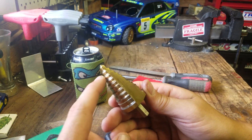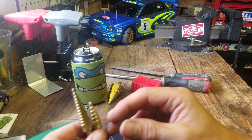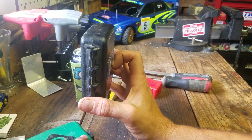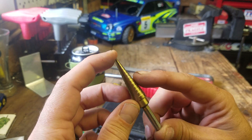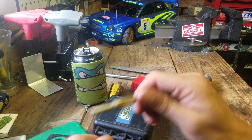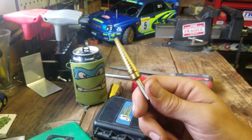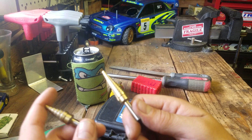This set is a two-pack for $20 that comes with one up to a half inch, and there's also a three-pack set. These have been really handy. For instance, if you have a box you're trying to mount and it comes with three or four mounting holes, and you need to mount it to a block wall — you drill your holes out, go to screw it up, and no matter what you do you can't get the box level. What you can do is take this and knock those quarter inch holes out to 3/8 inch, maybe use some washers, and then you can wiggle it and get the thing back into level. That's mainly what I use the small ones for. It's like twelve drill bits in one. These are worth it to have — the three-pack of small ones is like twelve bucks. Just buy them and throw them in your bag; you'll find a use for them.